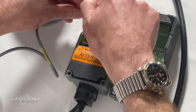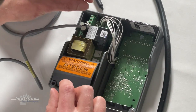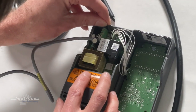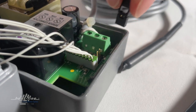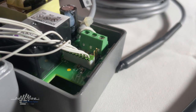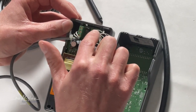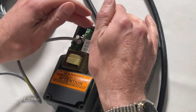You have your sensor wire connection, and what we need to do is unlock the keypad. Inside here is a little black jumper which is currently sitting on a single pin. What we need to do is make sure that this jumper crosses both pins. When the jumper goes on and crosses the two pins, the circuit board actually labels that position as the keypad unlock.